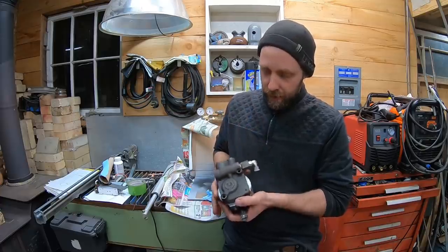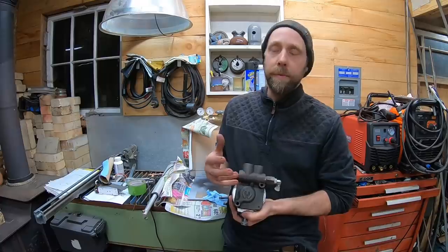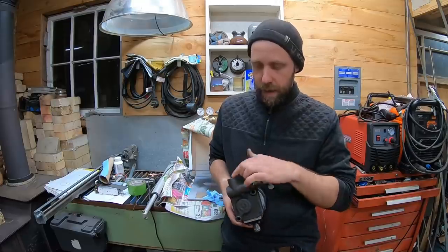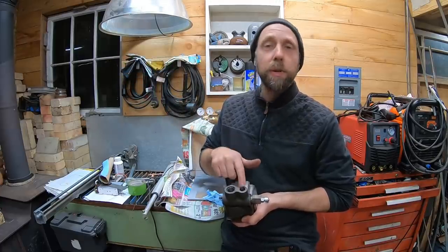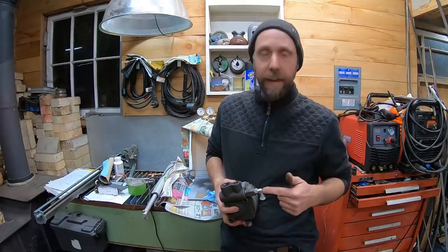So what's going on here is this pump was kind of a clever design as long as you have the whole system. I don't know a ton about hydraulics, but from the research I've realized that this is a priority valve in the back of it. It's got two main outputs. The larger one is for your hydraulics on a forklift to raise the mast and all that stuff. And the smaller port is for steering. And this third port on the side, this tiny one, is like a pilot actuator.